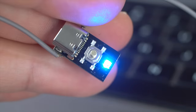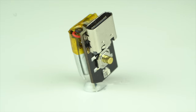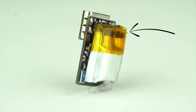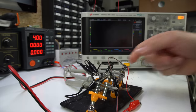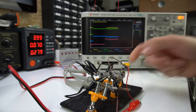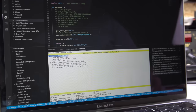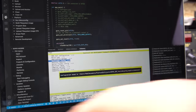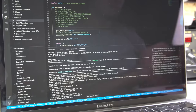Nevertheless, it has a few drawbacks. It doesn't include an embedded battery protection, so the external battery has to be equipped with one. Furthermore, it uses a GPIO for the latching circuit, involving a fast boot-up time and hence requires using the ESP IDF instead of the Arduino framework. Just being said, I really don't like the ESP IDF.